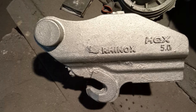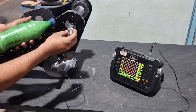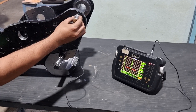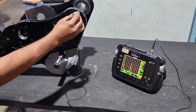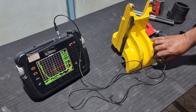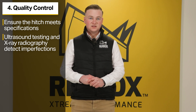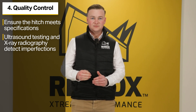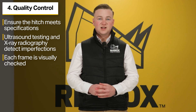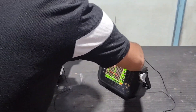The fourth step is quality control. Once the casting is removed from the mould, it undergoes a series of quality control checks to ensure it meets the specification and drawing. Inspections often include ultrasound testing or x-ray radiography to detect any imperfections in the cast, such as voids or cracks. Each frame is also visually checked against its dimensions to confirm it meets the specification and drawing.